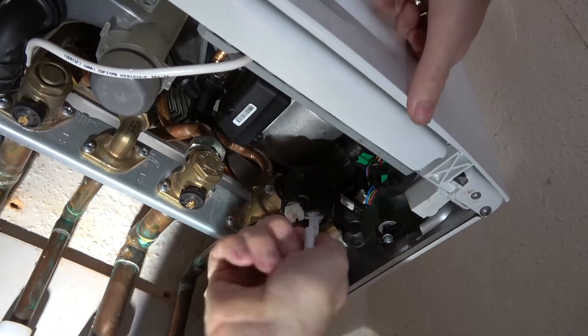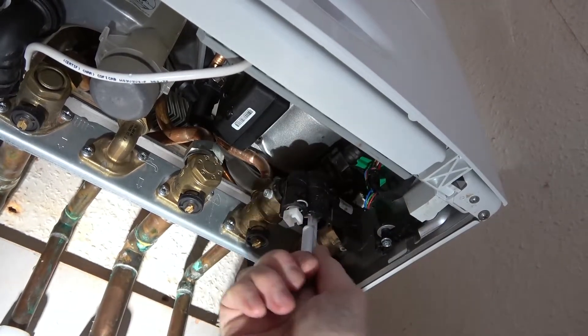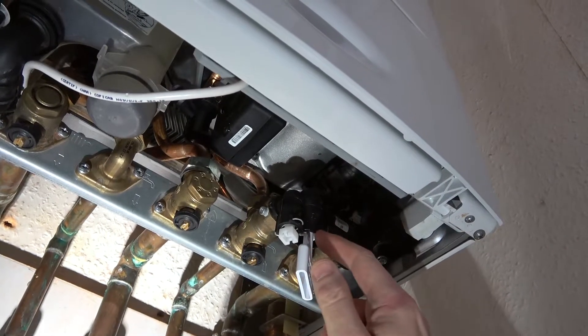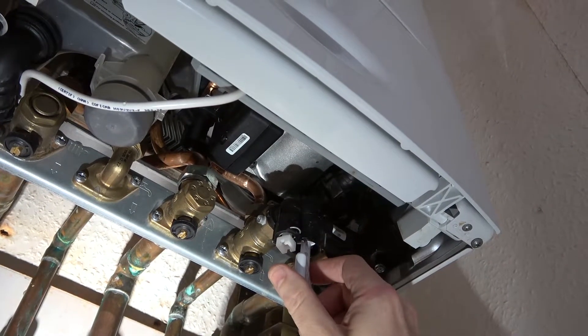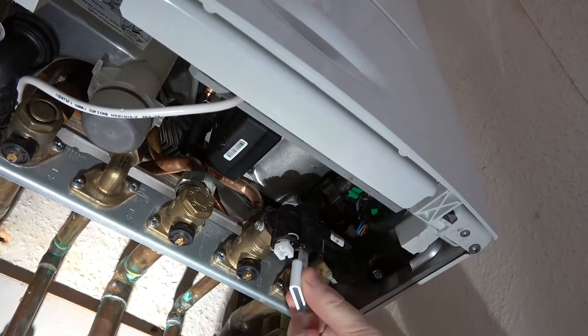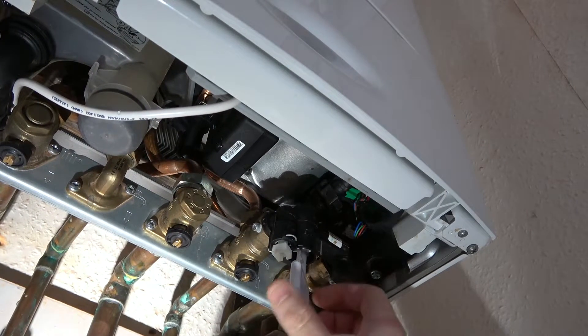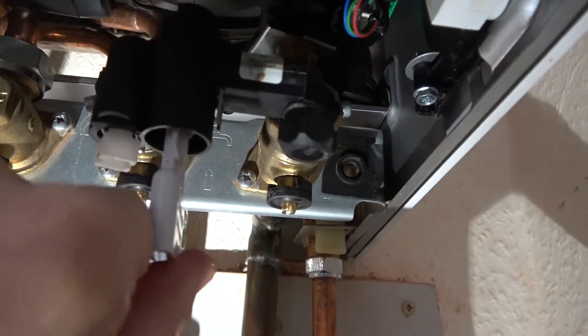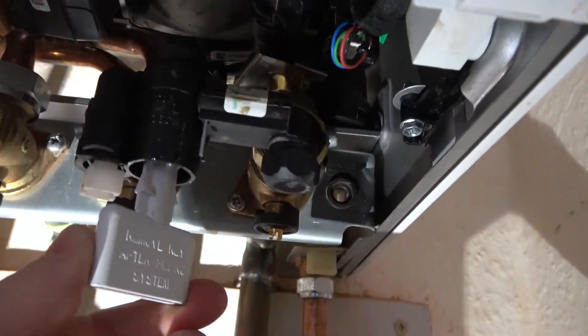Arrow on the unlock and I'm going to wiggle it. There you go — did you see it kind of went home? Now, if it just goes an eighth of a turn to the padlock, then we know we're okay. You can see I can't go any more in either direction. So now you've got it in that position where you've got an eighth of a turn. We're now going to put it to the lock position. Now I just want to show you the pressure on this boiler so we can see it going up.